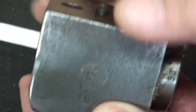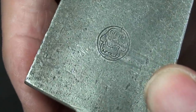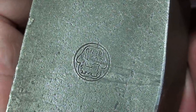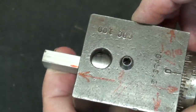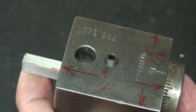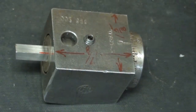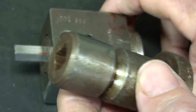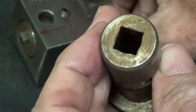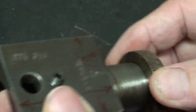This is the one I got from Henry — he didn't know what it was until he came to visit me. After cleaning it up, we found a South Bend logo on it. This one is used and modified or damaged by students over the years. Each unit came with four different tool holders of different sizes. There's a 10-degree angle here. One holder is for quarter-inch bits, one for three-eighths, one for three-sixteenths, and one for five-sixteenths.